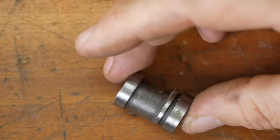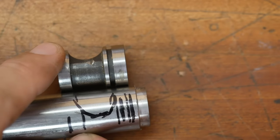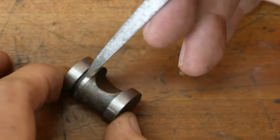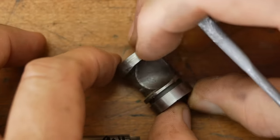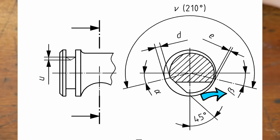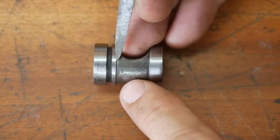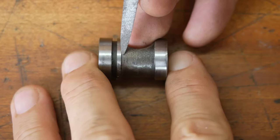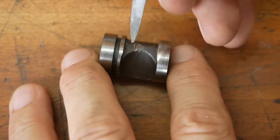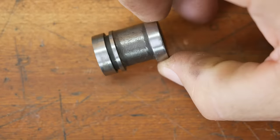I'm a little uncertain about my order of operations. Do I start with my bar of stock, turn the diameter down to 19 millimeters, offset it in the four-jaw chuck, and turn the cam? But then I need these two features — this machined curve and also this flat across here — they need to be precisely located. In the norm I think it's offset by 15 degrees. So if this is the high point of the cam you'd need to rotate it by 15 degrees, lock it and machine out this feature, and then you have 45 degrees to the alignment to mill this flat. How do I hold these and how do I locate them for that machining?